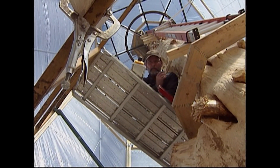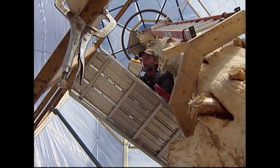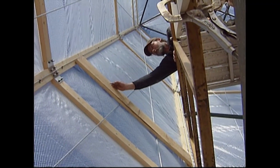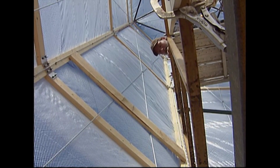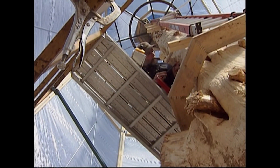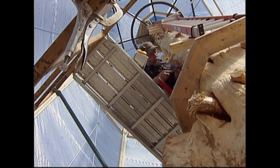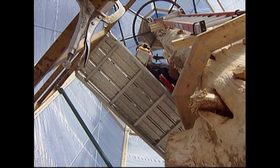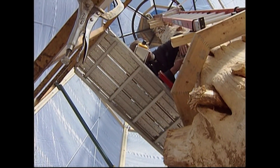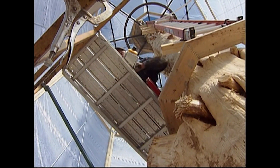This corresponds with the middle of the tree, and then I just gently spin the laser around and point it at my target on the other side. I can then mark the corresponding vertical line that matches up with the exact center of the stair tread. Coming back over to the center pole, the middle of the tenon is three and five-eighths inches below the top of the stair tread. I swing a mark there, then plumb down from that line to get the bisect point — the middle of our tenon on the outside.